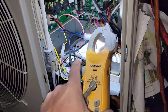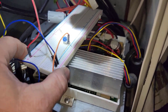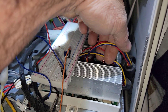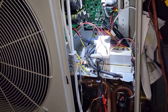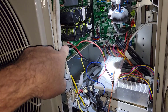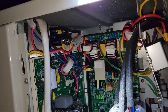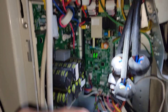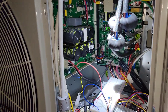The way these fans work — gotta be careful not to let any wires touch and pop anything — there's an inverter board under there, and it's basically three-phase DC, synchronized DC output. There's one fan, there's the other fan, so this board is powering both of these. This board is sending 330 volts DC from the rectifier. I'll keep that rectifier in here and just go straight from there to the other board — there's a capacitor on there so I should be able to just dump it in there, or if not I might add a capacitor. Then I have my own variable frequency drive I'm going to bolt in here to run the scroll compressor.